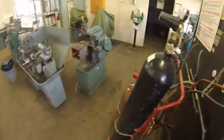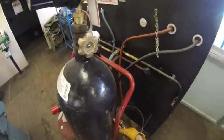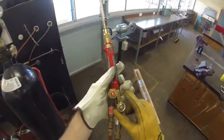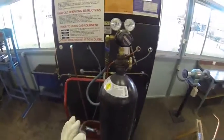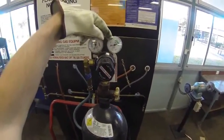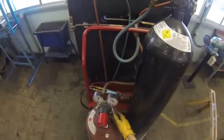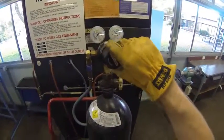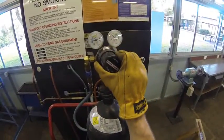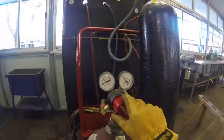We're just going to be heating the top section. Now I've got my flint to light up my oxyacetylene. When you come to use your oxyacetylene, there's lots of things you need to know. First, I've got my handpiece — I want to check that oxygen, blue, is off, and fuel, the acetylene, red, is off as well. Both are off. I come to the cylinders and open them up, then adjust the regulator. I'm going to put it at about 250 kilopascals of oxygen, and for my acetylene, I'll put it at around the 70 mark.